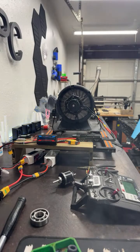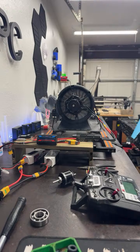I hope everyone enjoyed this. I really do. Hold on, let's see. Hydrogen. My man, that's what I'm talking about. Yeah, I'm eventually going to run this system off of hydrogen fuel cells, hydrogen fuel stacks, I should say. The idea is, I wanted to see what it would take to electrolyze enough hydrogen on demand to provide 48 volts at a peak of about 500 amps. That's about what I'm looking for.